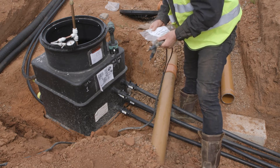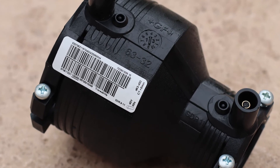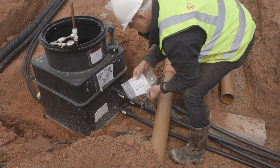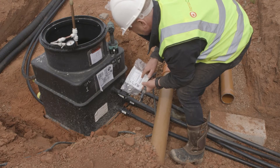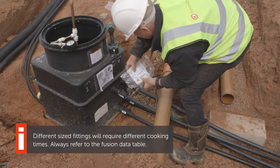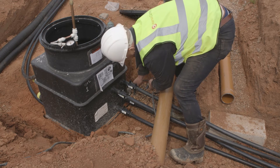Each of these fittings has got a little barcode on the side. There are electrofusion welding machines that come with a barcode scanner — you scan the tag and it tells the machine exactly how long and at what temperature you've got to cook that fitting. But if you look at the bag the fitting came out of, it's your fusion data table. It tells you a range of temperatures; if you're between 5 and 14 degrees outside — which we're probably about 10 to 12 degrees today — we're going to cook it for 40 seconds. Generally you're around 38 to 40 seconds.